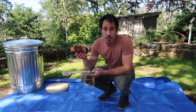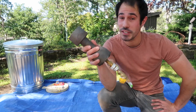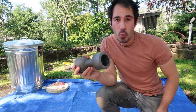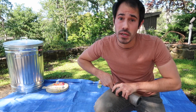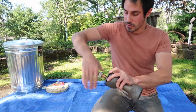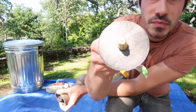Next up, I got a pyrometer as well as a thermocouple to be able to see exactly how hot the kiln is getting. Here is my burner, which is quite important. So make sure, I had to wait a little while just to make sure the parts were right, but the orifice inside should be, because I'm doing a propane setup. You can also do a natural gas burner if that's what you're looking for. But for me, I'm choosing to do propane, and the orifice looks like this.